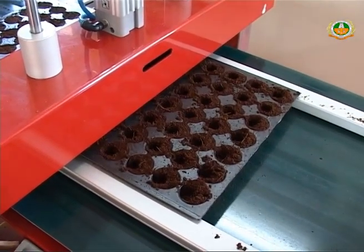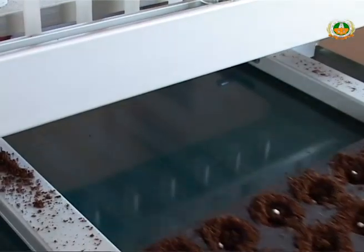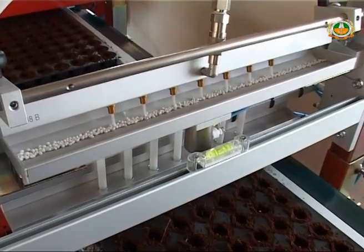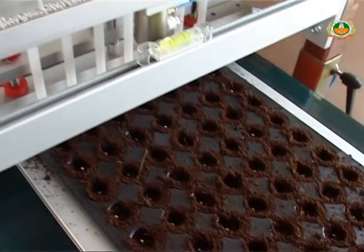Variable adjustment of the speed of paddles, transport belt, and vibration ensures the required density of the growing media in the cells. The bar seeding mechanism allows naked or pelleted singulated seed per plug, suitable for all kinds of vegetable seed, applicable by changing the needle.